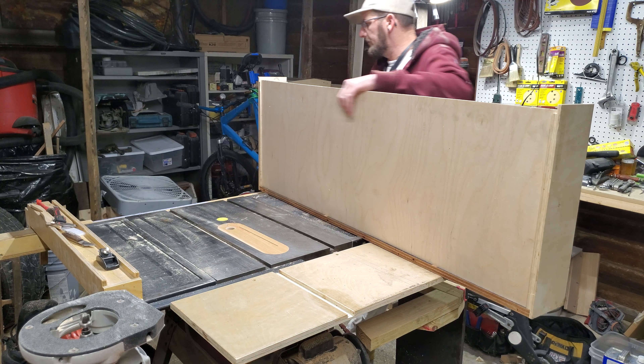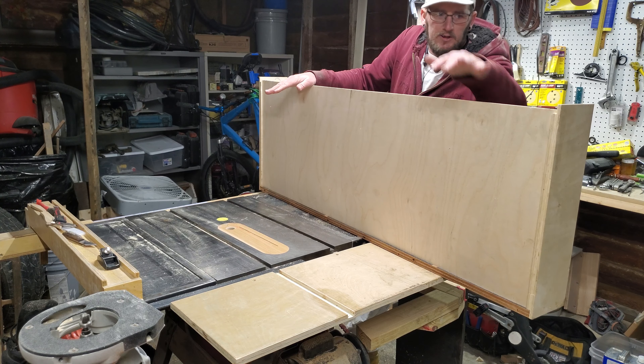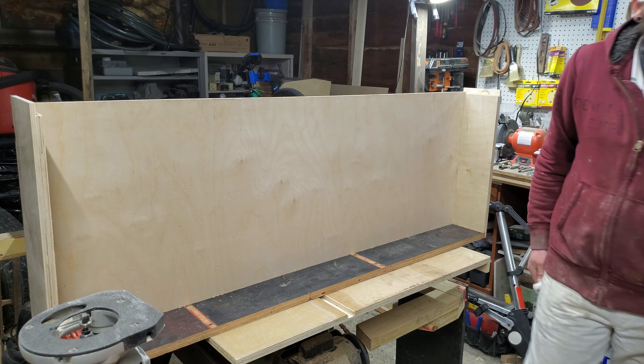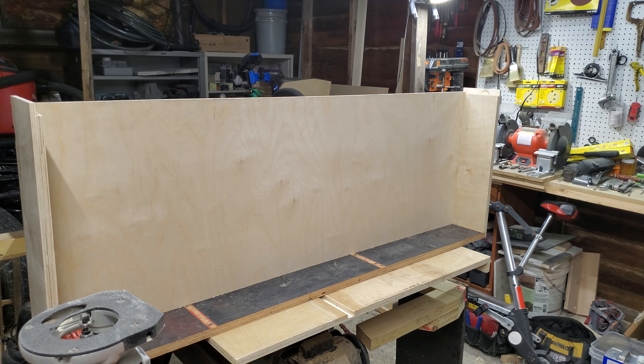Here's this — such a pretty piece of wood. I hate to use birch for a cabinet bottom. Oh, that's so beautiful. I don't even need the glue. I could glue it in, being that this is an entire plywood box. But look at that fit — just gorgeous.